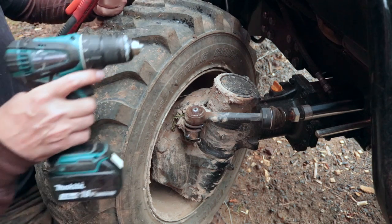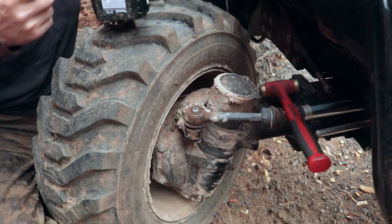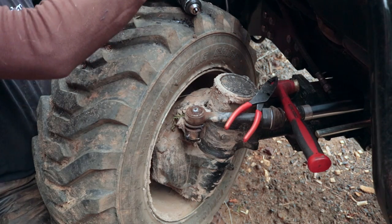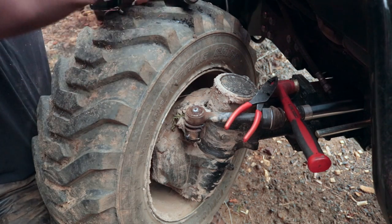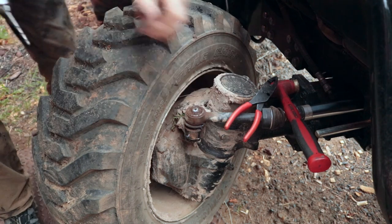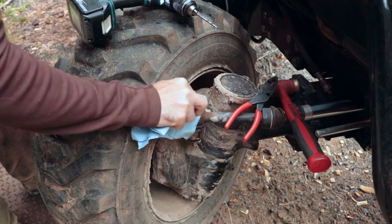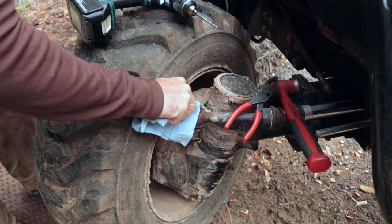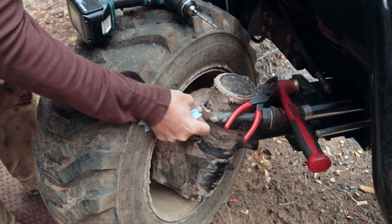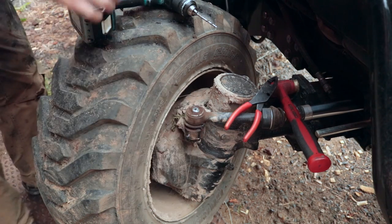The tools we're going to need for this procedure: of course a drill, a brass hammer — which I'll explain later; you don't have to use brass if you don't have one, a wooden mallet or something softer than tool steel works — and of course the extractor bit. Let's clean that off a little bit. We're going to use a shop towel; we don't want to get any more shavings in there than we absolutely have to, though there may not be a way to avoid it entirely.